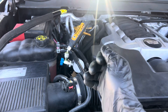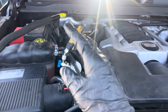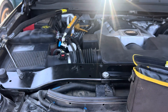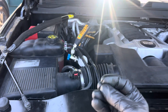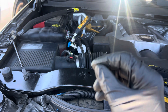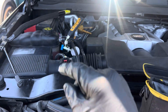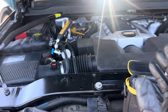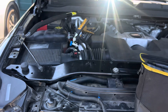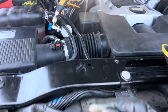It's not instantaneous like when you first hook up a vacuum pump and see that great change. It's not linear — it's logarithmic, it gets exponentially slower. The way I'd describe vacuum: to get to 29 inches of mercury is like lifting a feather pillow over your head. The energy required to get down below 500–200 microns is like lifting a refrigerator over your head and climbing up the Statue of Liberty steps all the way to the flame.